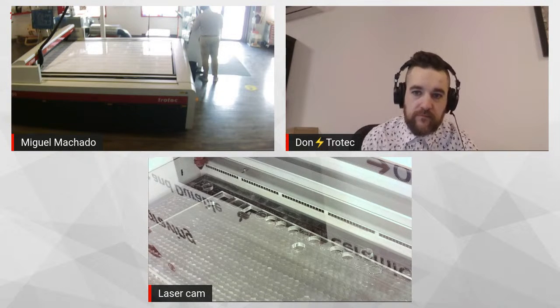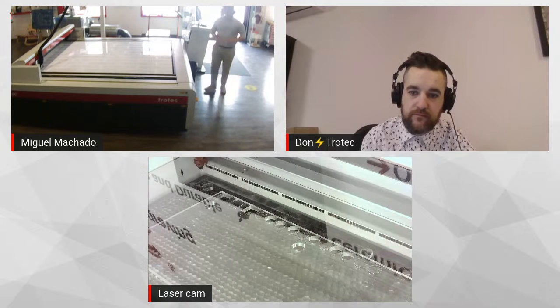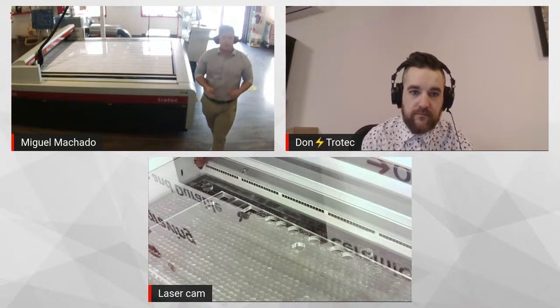They don't have a lot of that problem because they use the 5-inch lens, right? Those ones are not completely circular, so it's a bad example. But they have a 5-inch lens, so the dot size is much bigger. That doesn't happen as often as it would on a smaller dot size, which is great for engraving, but when it comes to cutting acrylic, that might happen.